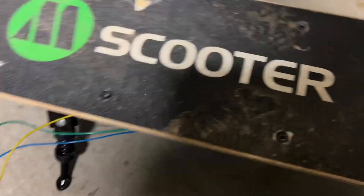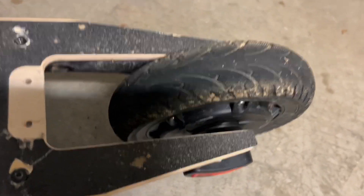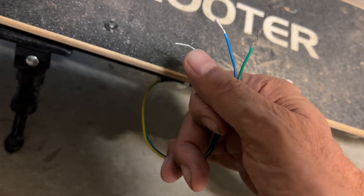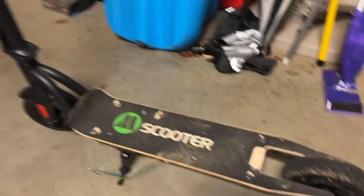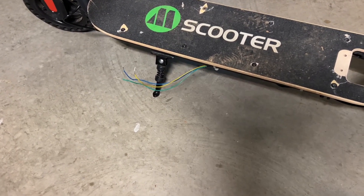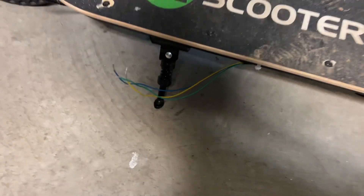Now let's check the bike. After removing the battery pack, the inverter, and all the other unnecessary circuitry, I stripped the wires off the three-phase motor that's in there. I'm going to come up with a three-phase rectifier — I'm just going to solder one up and use this to charge batteries and do other things while I use this as a regular unpowered scooter. I could even run lights and other things with this. First I need a good circuit for a three-phase rectifier that can handle an output voltage of around 48 to 50 volts.